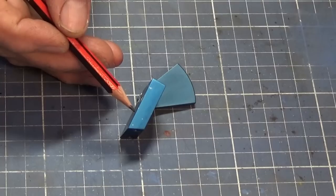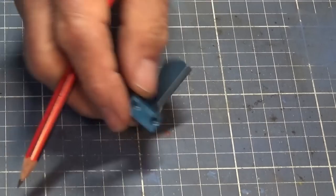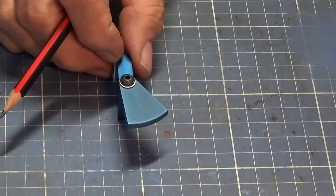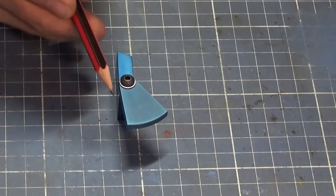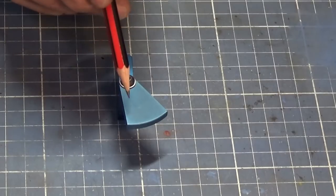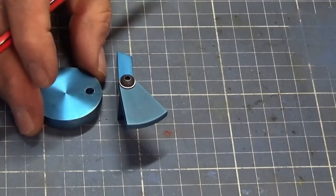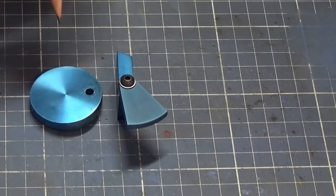But when I changed the CAD model to give us that 65 included angle, it also had an effect on the radius of that little sector plate there. Now, not by much, it was only like a couple of fractions of a millimeter, but I've made it correct. It should give you a true angle of 25 degrees when you drop this sector plate down onto the carriage. So again, these are the parts that you need to ensure are correct, and if you've got the latest version of the drawings, that will happen.